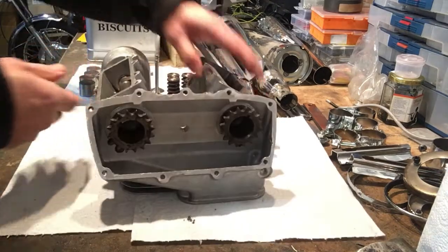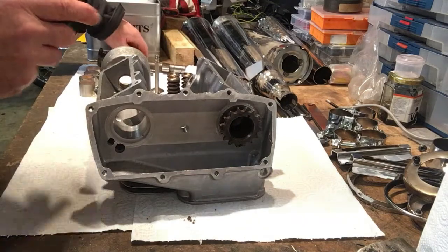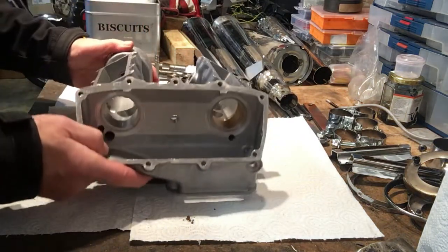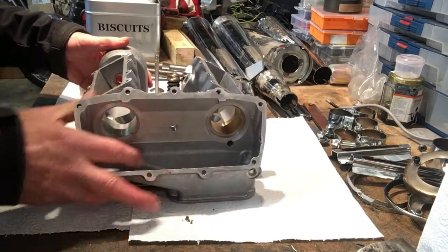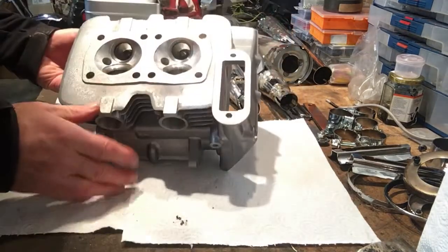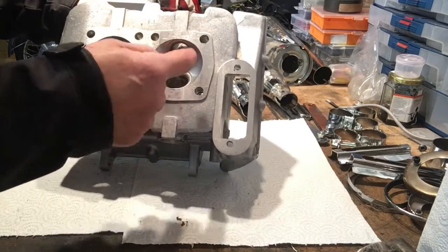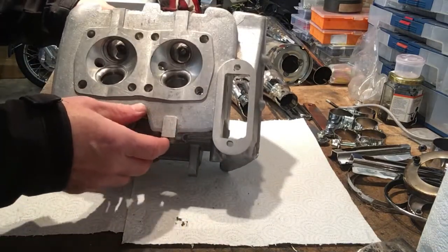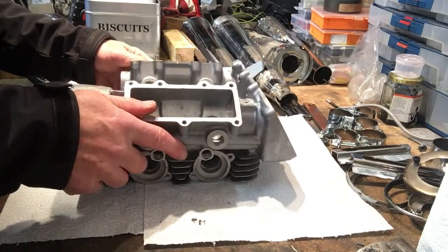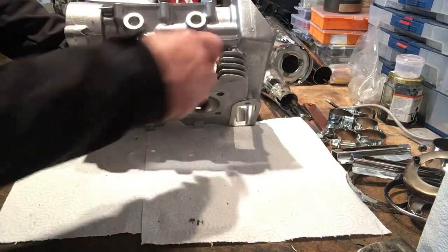And actually there was, if you've read Brad Day's excellent book From the Inside about Umberslade Hall, and some of the stories from Tom Gunn about his review of the design of this head, he was absolutely shocked at this design, because although it's a double overhead cam, he thought it was a very, very inefficient head because of the very shallow angle of the ports coming into the head, especially the inlet port, I think. And the general consensus of him and Jack Williams and maybe one or two others was that they needed to make the depth of this head much bigger, so that there wasn't such a shallow angle going in.